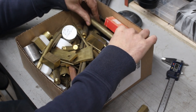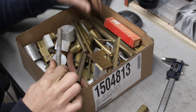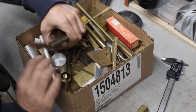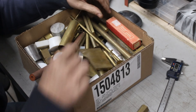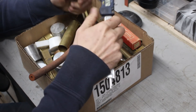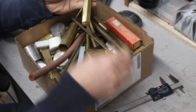Now we have to choose stock - we need something around 20mm. So that's going to be a metric project. I haven't worked in millimeters for ages. I found a hex profile piece - to be honest I don't see anything else available. That's going to be nice because it's a hex profile so it's going to look like a bolt at the end. Let's measure - that's exactly 19mm. We're going to use that.